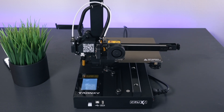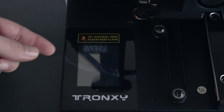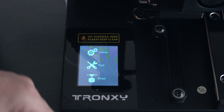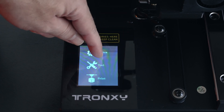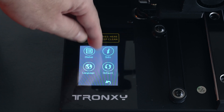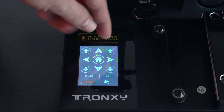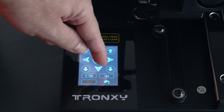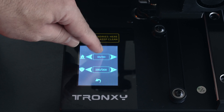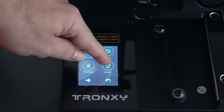The bed is at 55 and almost at 60 already. The screen dims/turns off and you can touch it to power back on. On the main menu we have System, Tools, and Print. System has status info, language selection, and reset to default. Tools has Manual mode where you can move individual axes and home the printer, with movement increments of 0.1, 1, and 10 millimeters. Preheat lets you click the temperature numbers to toggle to 60°C and 200°C or back to zero.